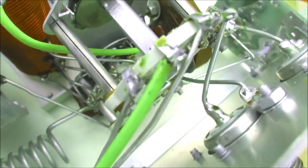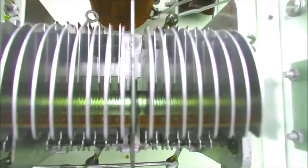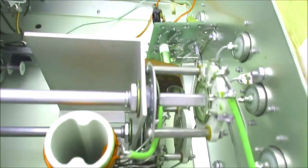You've got the switching mechanism here for the coil — I've pulled this back out of its case a little — and as well as the band switch, you've got three different positions you can adjust on the front of this ATU. But I think the key thing to the power rating is these variable capacitors, as against these, and that is the reason why I'd be quite happy to put 300 watts through this ATU.